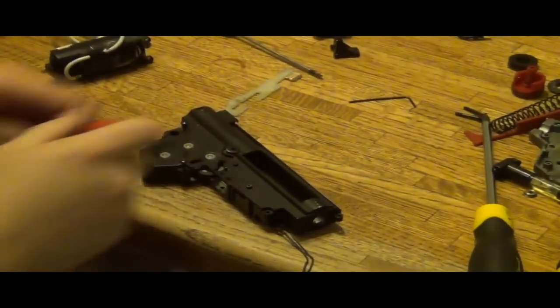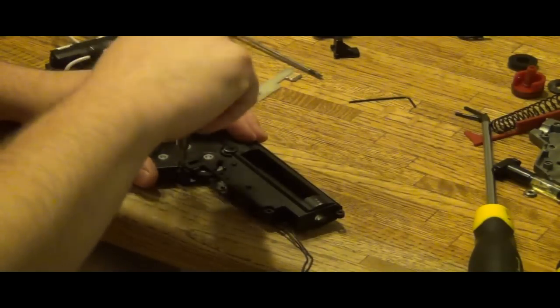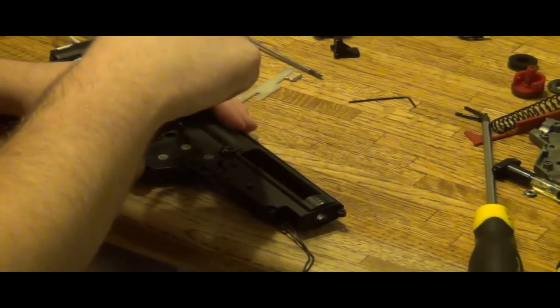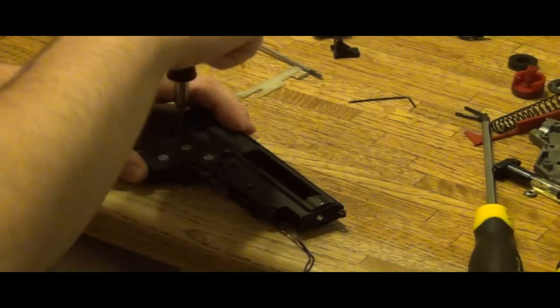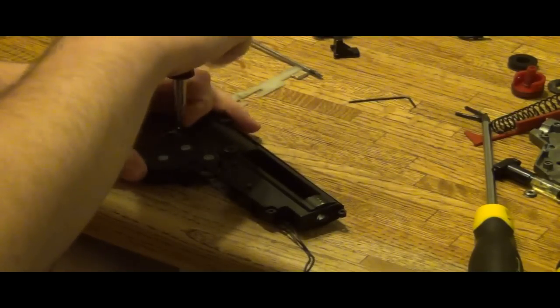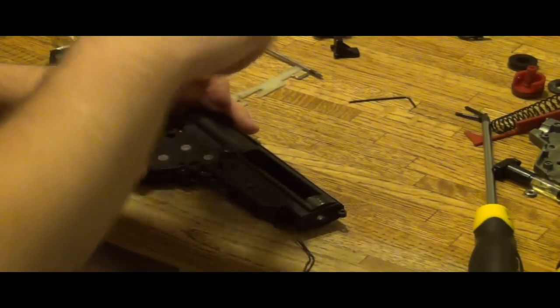It's working, but we need to close up the gearbox tight in this area to see how well it's working. So go ahead and tighten the thing real quick. And you want to check it. You also want to look at how well it attaches to the bevel gear, because if it's not attaching very well, or if it gets obstructed by the pinion, hits into the pinion, then you're going to have a real issue. I do not know why, but this last screw up here gets to be a pain. I have to go real far backwards to even tighten it.